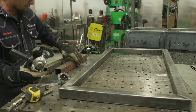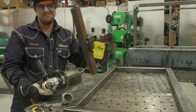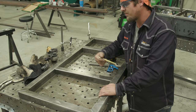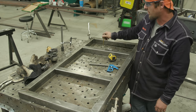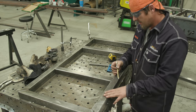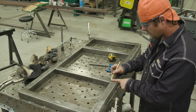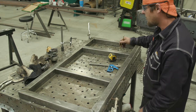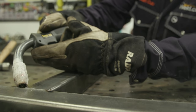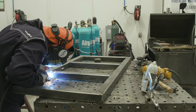Well, we pre-ordered this tube like 2 or 3 months ahead of time. And yeah, it sat outside in the dock for a while. So we got the square here, 48 inches by 24. So I'm taking 48 divided by 3 because 1, 2, 3 areas. That'll give me the center of my tubes. So I'm gonna go 16 by 16. Then I'm gonna go 1 inch because it's a 2 inch tube. Mark my center there. I already have a crow foot with a line mark, match that up, boom, boom, tack it, you're done. Fast, and you move on, weld your other side and weld this side. Then you get the big man, Jason, to give you more instructions to do. That's it, ladies and gentlemen, boys and girls of all ages.